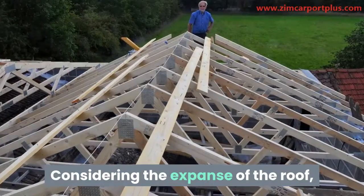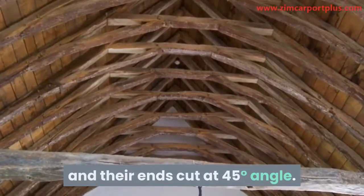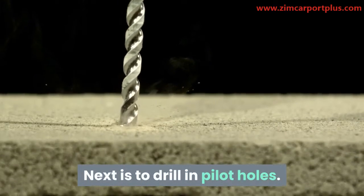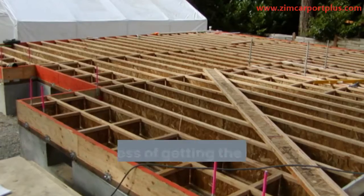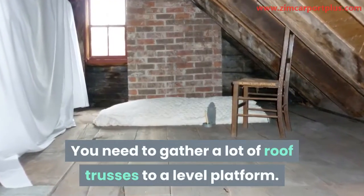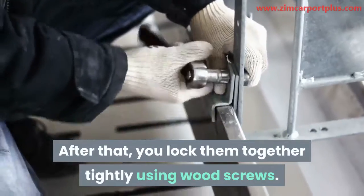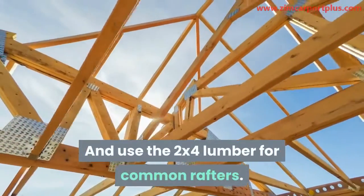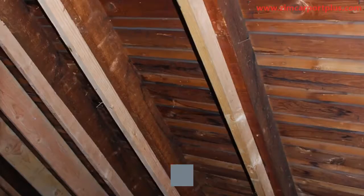Considering the expanse of the roof, the frames need to be reinforced using braces. The braces should be built using 4x4 lumber with their ends cut at 45 degrees, then attached into place. Next is to drill in pilot holes, which will be locked into place using 3.5-inch galvanized screws. The process of getting the roof built can be quite complex because the frame is wide. You need to gather a lot of roof trusses to a level platform. The components need to be cut into the right sizes, then lock them together tightly using wood screws. Use the 2x6 lumber to make the underneath rafters and the 2x4 lumber for common rafters. It will be wise to include many intermediate rafters at the end of the trusses — they will help support the gable ends.